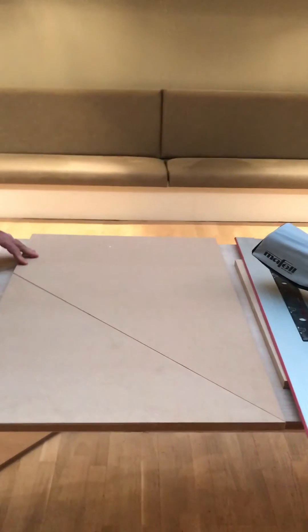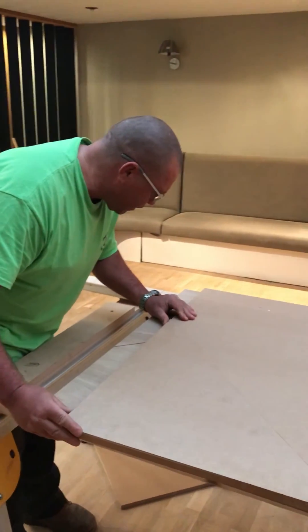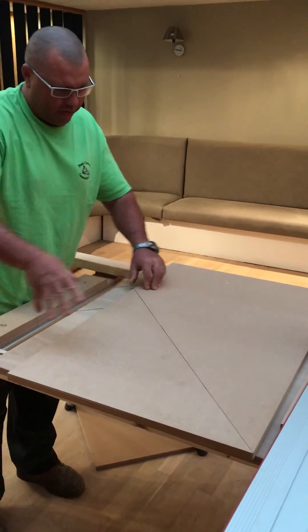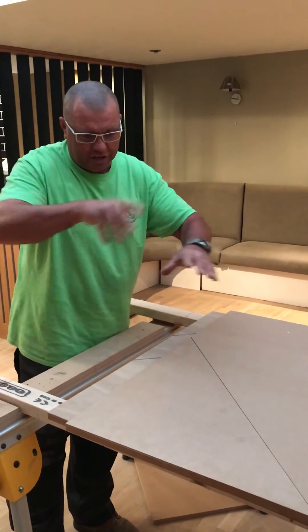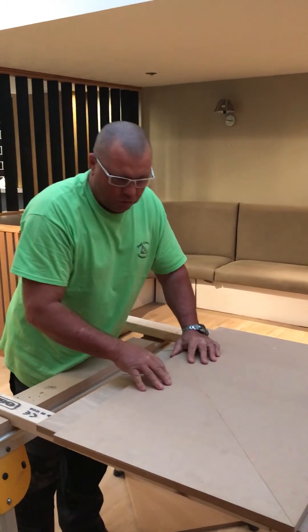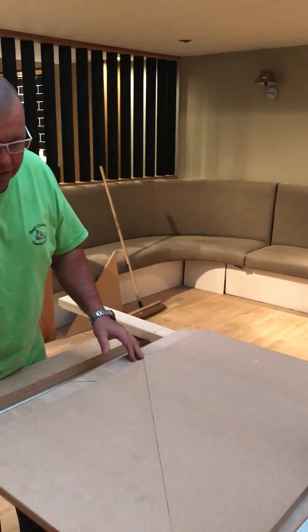There we go, that's your 45. I'll just put that in so you can see it — it's quite a good cut. It's ideal for doing anything with a mitre, doing anything like the worktop with the block effect. I like the block to run together instead of running separate, so any worktops with the block effect I do at 45 and bolt them together. So that's the 45.